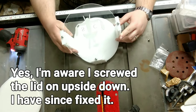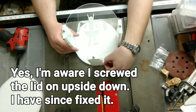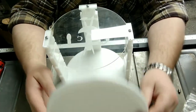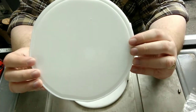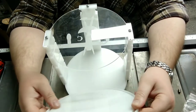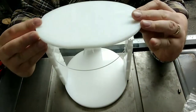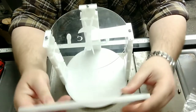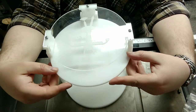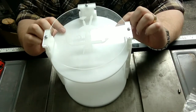Our rack system is all set up. Let me lower you down and get you a better angle so you can see some features. The rack system is pretty neat. It's got these shelves here, and the shelves are all HDPE. They have grooves on the underside that serve a very special purpose. When you slide the shelves in, there's a rounded edge on top and three flat edges. Those flat edges correlate with the sides, so you line them up in the grooves, slide it all the way back, and those grooves actually lock the shelf in place so it doesn't move.